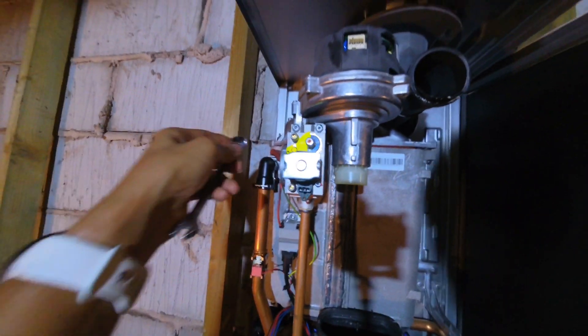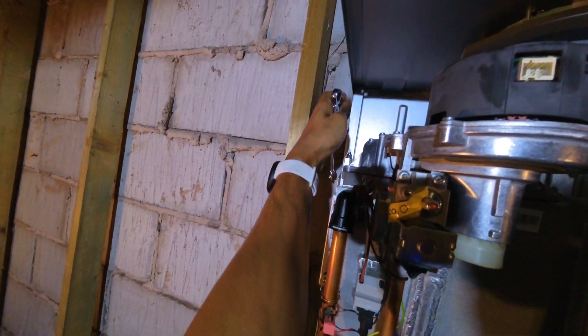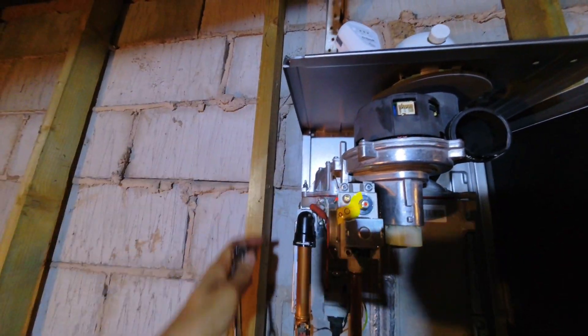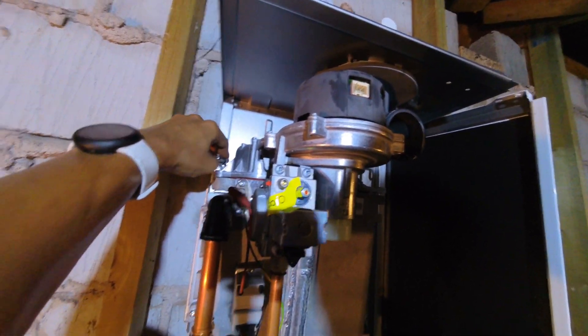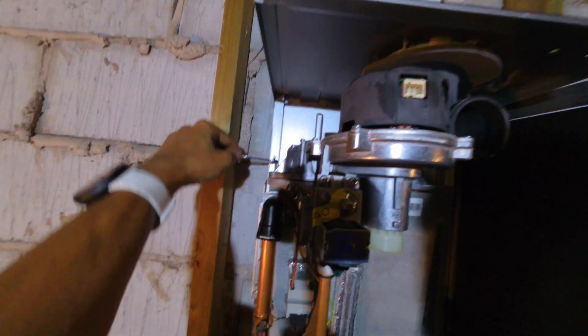I took the left-hand side panel off because it was just getting in the way. You would not be able to get to that nut without taking it off — imagine the panel sitting right there, you're not going to be able to get anything in. Believe me, I've tried, and even on the Vaillant training course they said you've got to take the side panel off otherwise you're not getting that nut off. If the pipework is touching the case you may need to move it. Even my ring spanner doesn't fit on there because it's hitting it, so I've had to do it the old school way with an open-ended spanner.